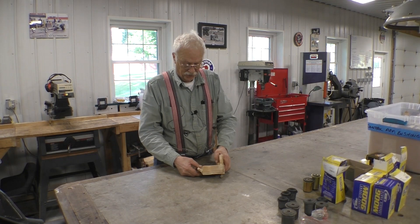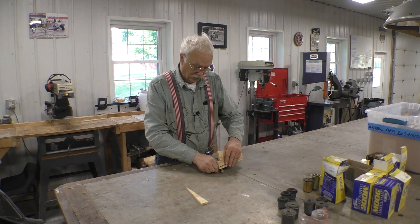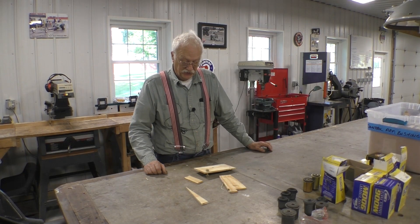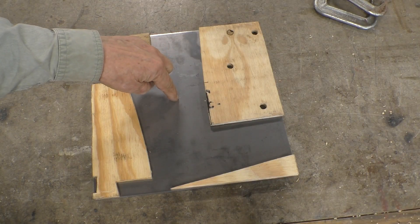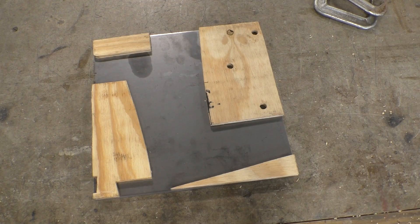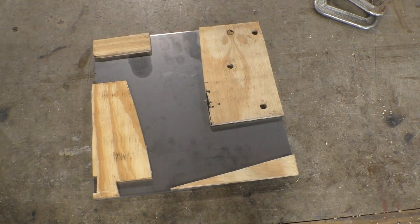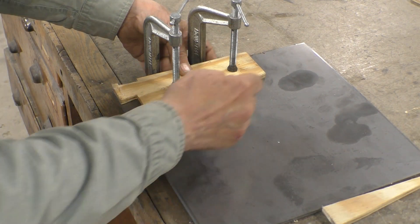Let's break this apart. There's the first piece, the second piece, the third piece. Now we've got to lay this out on a piece of metal and cut it out. I went to the metal dealer today and was able to purchase a drop — a piece of metal left over from a previous job, which you can usually pick up fairly cheaply. This drop has nice straight square edges on it, so I'm going to utilize those edges as much as I can. The next step is to scribe the outline of the pieces into the metal and cut it out on the bandsaw. I've clamped our first piece in place and we'll just scribe it.